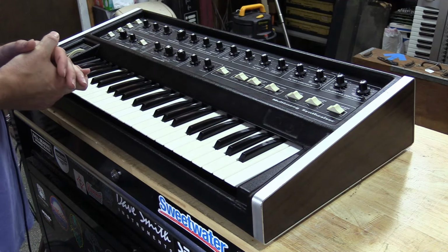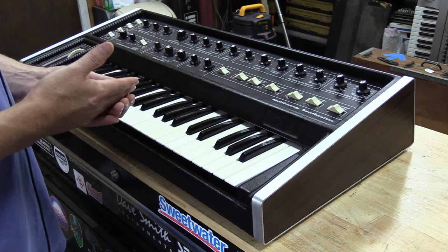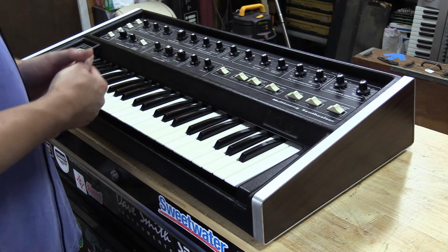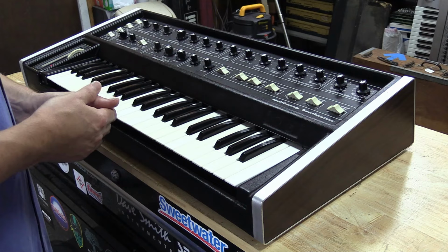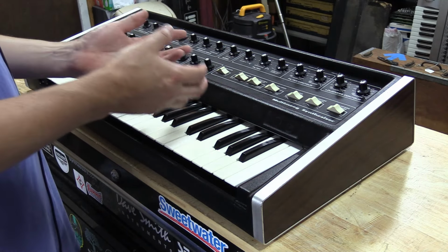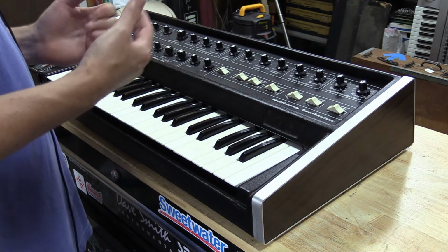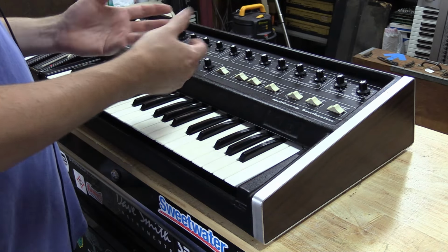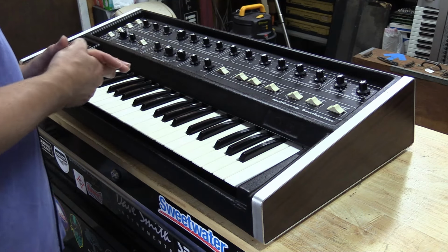So what it does is it's actually not just a filter, but it's actually a true sine wave oscillator in the way it's designed and the way it's controlled by CV. It's still the transistor ladder filter we know and love by Moog. It's just the way that they combine some things in this circuitry design to make it a little bit different. And for that reason, it has a different tone, a little bit different flavor, and it does some things a little bit different.